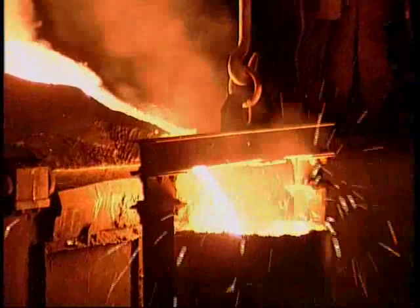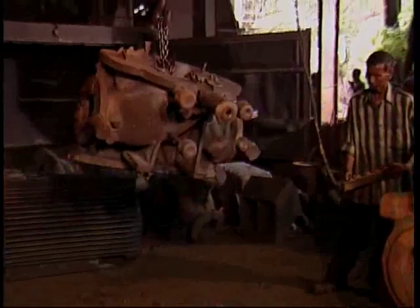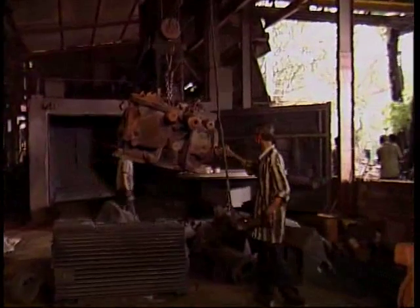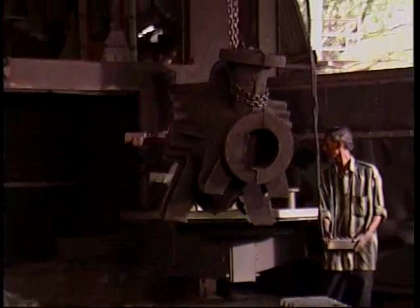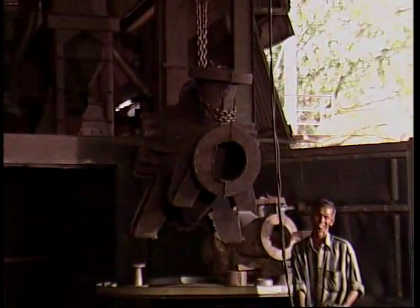We have to make sure that the pouring temperature is about 1,400 degrees centigrade. After knockout, the casing casting is subjected to shot blasting. Shot blasting is done twice. After the first round of shot blasting, the casing is thoroughly checked to ensure absence of casting defects such as blow holes and shrinkages. Castings are then fettled and cleaned manually.